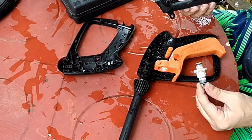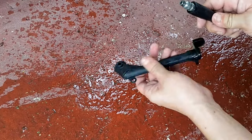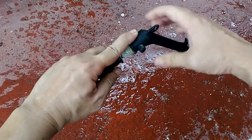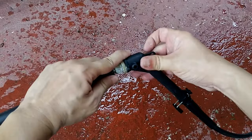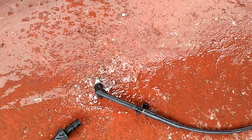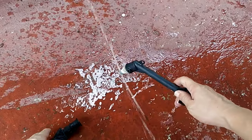But I find no cracks nor worn-out O-rings in this one, so where's the leak coming from? To see where water actually seeps out, we'll do an actual test. We'll connect the pressure washer hose to the stem and connect everything else, then we'll turn on the faucet. And whatever you do, do not turn on the pressure washer itself — that would be dangerous. Now that water's flowing, it's easier to see exactly where it goes when I join all these inside parts.